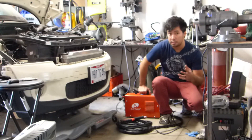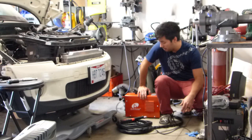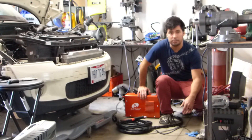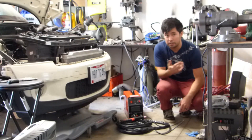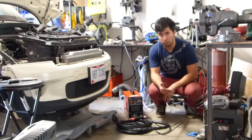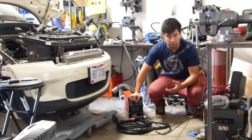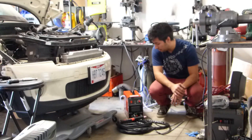I did read the spec manual, and something I want to address to the actual manufacturers: please update the spec sheet so that you have different cut rates and what the minimum amperage requirement is for cutting different thicknesses. At the moment it basically just says if you want to cut quarter inch, half inch, or three-quarter inch, you just turn it all the way up to max amp, which is 50 amps on this machine. That doesn't really tell you what a clean cut is going to be or how you can use maybe less amperage — for example, if your breaker keeps triggering like mine. It's really cold in the shop, and trying to work here in the garage I want to be able to have the heater on and adjust this to just what I need rather than all of the energy all at once.